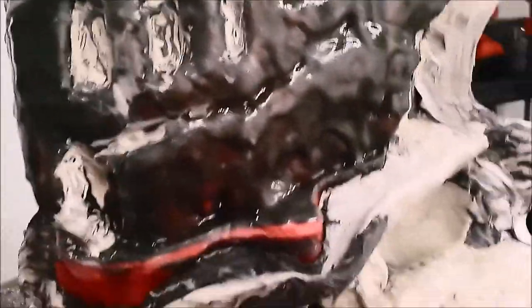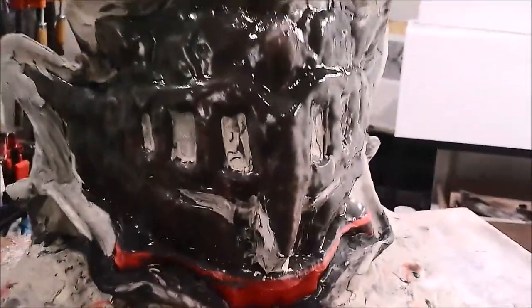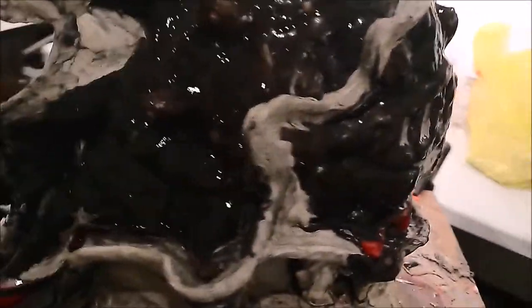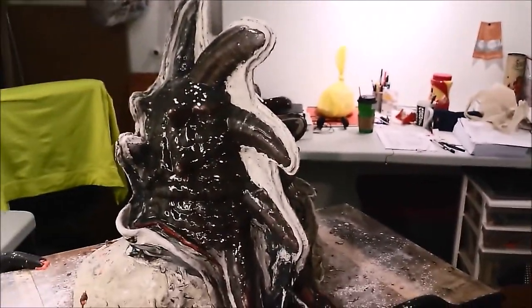The very first thing you want to do in preparation for the mother mold is fill recesses and undercuts. You cannot afford to have your mother mold grip the child mold too tightly. Just remember, nobody wants a wraparound from their parents. I generally use a clay wall, which I will remove during the mother mold making process.